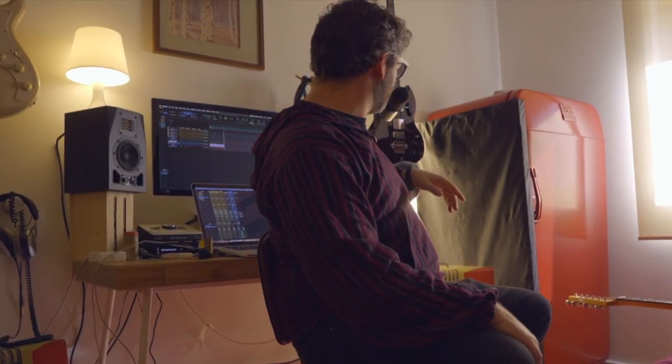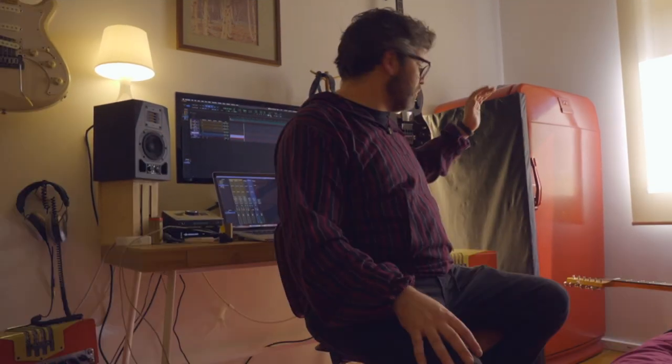The third step was to cut the reflections from the sides. That's crucial and very important. I have it here because it's the first reflection point. How did I set this? I got my son to move a mirror on this side of the wall, and the minute I see this speaker reflected in that mirror over there, that's where the acoustic panel needs to go. So this panel here is exactly where I see it sitting down here at this position.